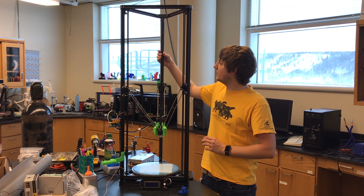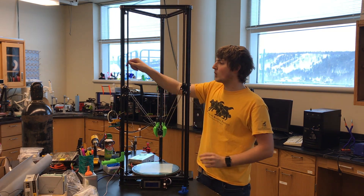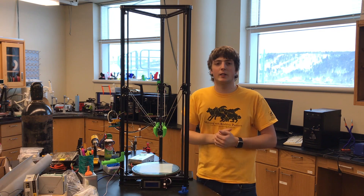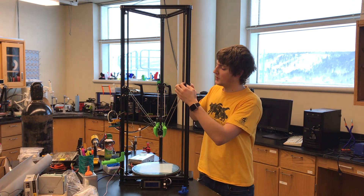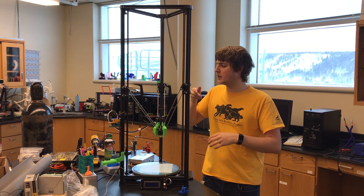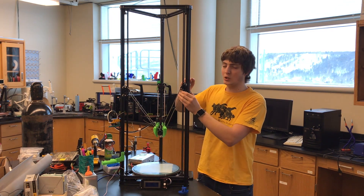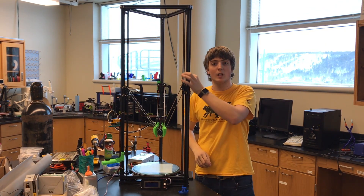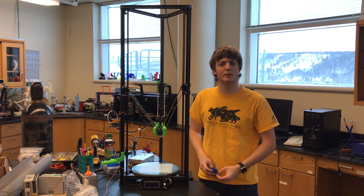This does not have linear rails, but it does have linear guide pulleys all the way around, which are connected with belts. One thing I'd like to note — in the build I forgot to do this — there is actually one side that has a concentric or offset nut which you can tighten with a wrench. It allows this to be super tight so it doesn't wiggle around on the uprights, which was a problem I originally had when first trying to print with it.